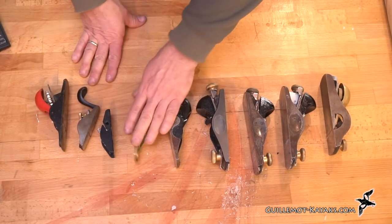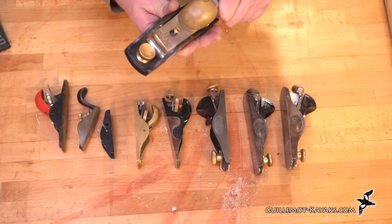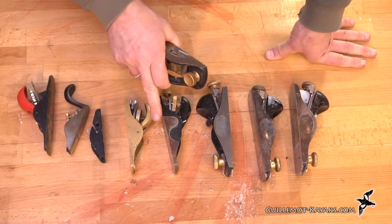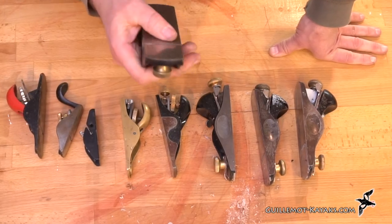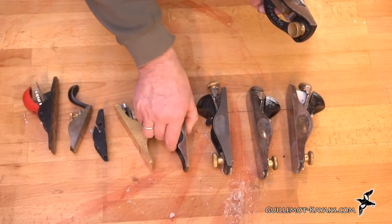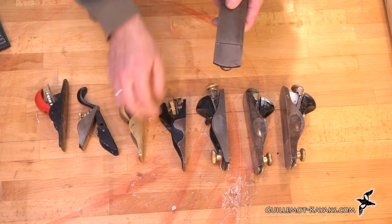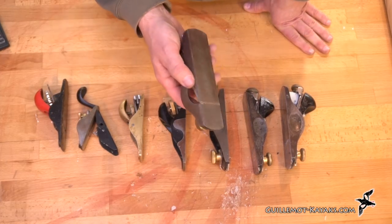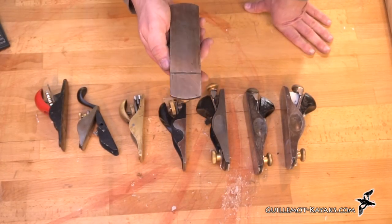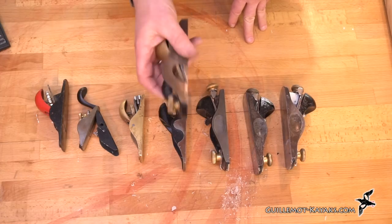The other planes here are specialty planes — still block planes, but a little more specialized. I've already talked about this one in my rabbet plane tool talk. This is a block plane, and I could do all the block plane work with this that I do with my apron planes. It's a very nice tool with very good steel. It doesn't have all the adjustments that the Veritas apron plane has — it's pretty much just an in-and-out like the little block plane. It's a low angle, and when tuned up and sharp, it does a wonderful job. If I had to buy one tool and wanted the capabilities of a rabbet plane — cutting all the way out to the edge — this would be a great tool to have.